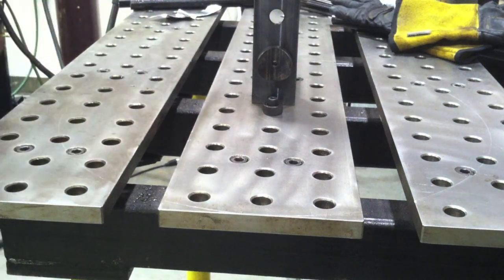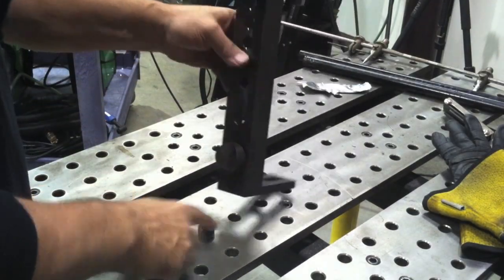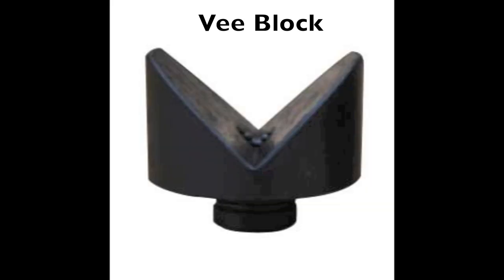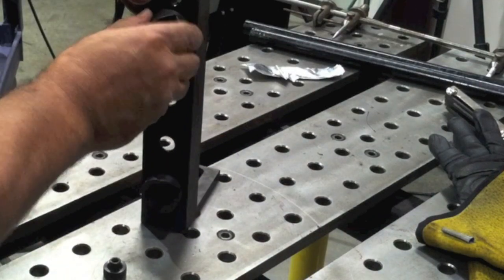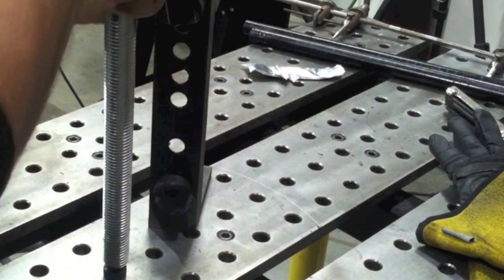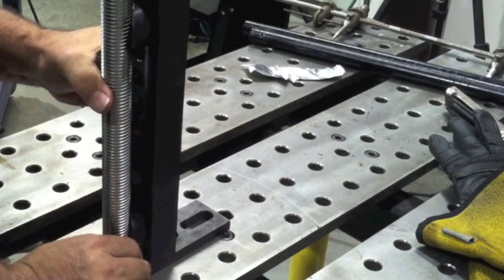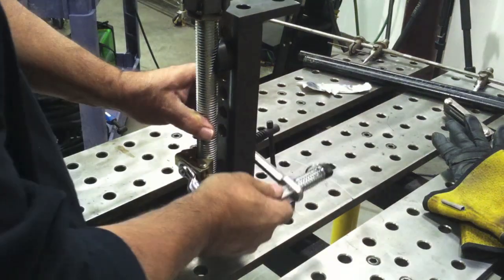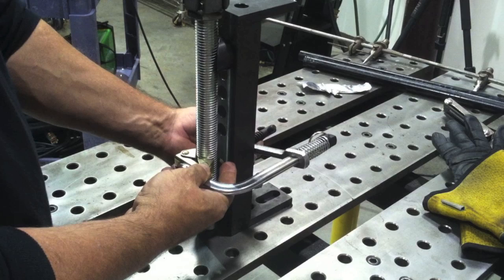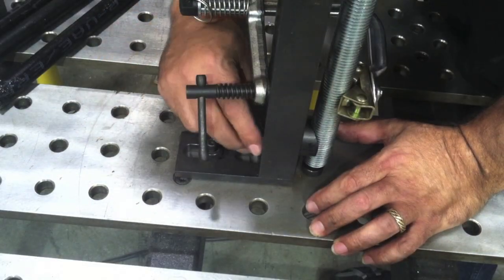To line up the riser piece, I'm going to leave the all-threaded piece in the hub assembly I just welded up and use these V-blocks. They have a little O-ring on them so they pop in on the table or on the riser pieces to hold round stuff, and with that O-ring they stay upright and don't fall out — extremely handy. I'm lining this all-thread up with the ball lock bolt at the center point of the circle, using a 90-degree riser piece and a little mag spring clamp — a one-handed affair — clamping it carefully so the swivel V-pad with magnets doesn't damage the threads.